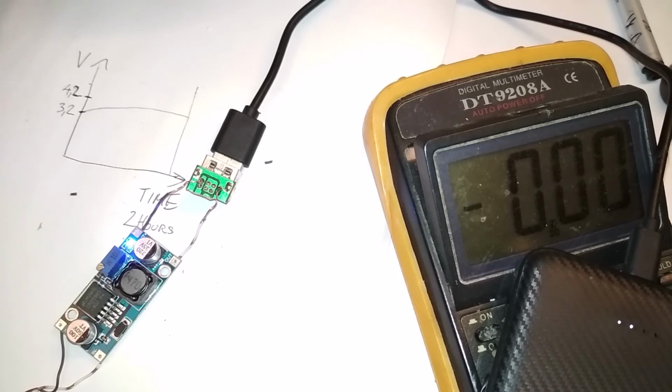Because the charger is inside the phone or laptop, and the battery also has a protection circuit inside, separate from the charger. And that protection circuit monitors the temperature, I think, and the internal resistance of the cell, hopefully, if it's advanced enough. Some Chinese solutions may just bypass all that and say it's all good, and then your phone will explode at some point. But in theory, the protection circuit has to monitor the cells and switch them off if there's a problem. And the charger is inside the phone or the laptop, and it manages the battery.